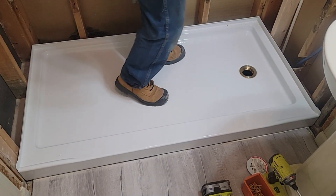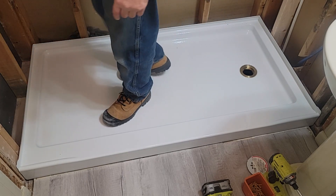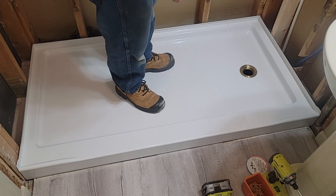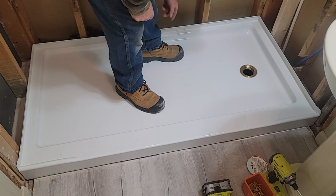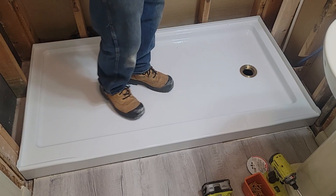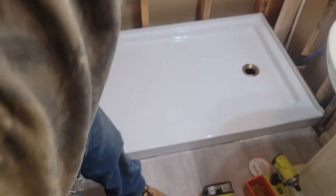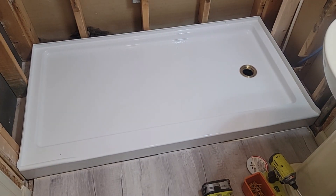But with this one I'm still going to attach it to the wall. I hate to put screws into the lip — I prefer the style that has a metal clip like what was on the tub, and then you put a screw up here. But I'll check the directions again. They want you to put one in each stud — it's a little overkill. You've got to keep them up high enough that you don't get any possible water intrusion. Let me go check the directions quick and get a drill bit and some screws — I'll probably put some ceramic-coated screws in so they won't rust.